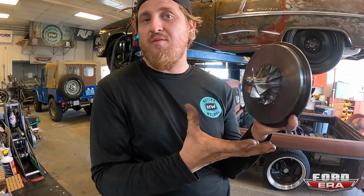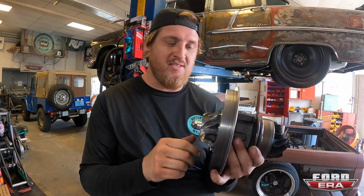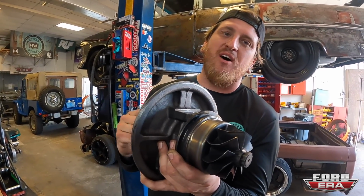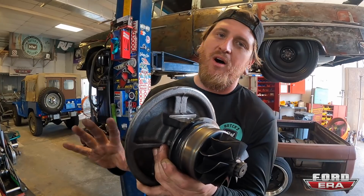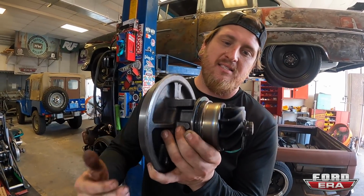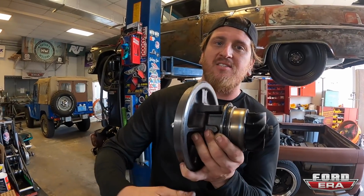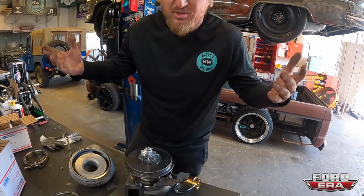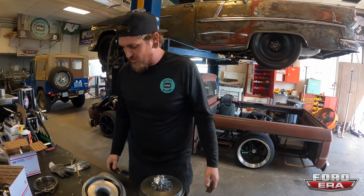And what I personally love about turbos is that it's essentially recycled air. There's no loss like you found in a supercharger. You know what I say, belts are for pants. Because what happens is you get a lot of loss off the crankshaft of the supercharger. Don't get me wrong, they're great in many applications. I'm just a turbo guy, so like I said, it's nice because it actually uses exhaust gases to recycle that and create power. And it's unlimited, essentially. You can kind of just keep turning up the boost until you run out of turbo.